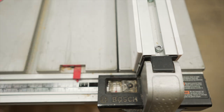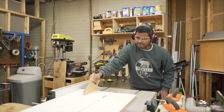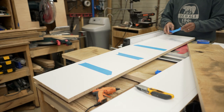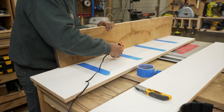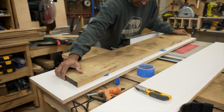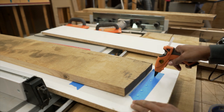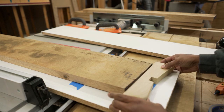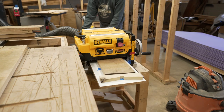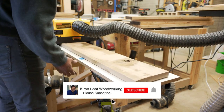Then on to building a quick jointer sled for this planer. I cut a very straight melamine board at 12 inches wide. I attached some blue painter's tape and hot glue to secure the board that needs to be jointed — if you have a board that's cupped a lot, you might need to use some wedges. This board was fairly straight but the surface was really marred. I also attached a small wedge piece at the end with thickness less than the piece being jointed; this helps keep the board against the forces of the rollers. I'm taking really shallow passes — you definitely don't want to take more material than your planer can handle. It's best to be patient and take a little out at a time.